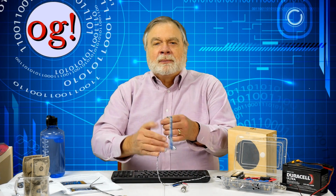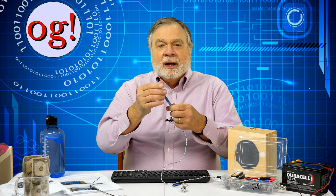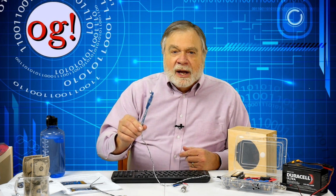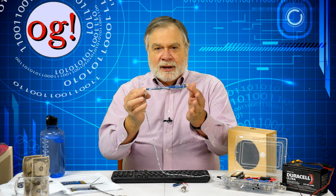I twisted some hookup wire to create a cable about 2 feet long. I very carefully kept track of polarity, making sure that the case connector went to the mono connector shield and the other lead went to the tip. I opted to tape the mic to a pen to give it something to hold onto.